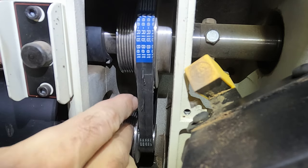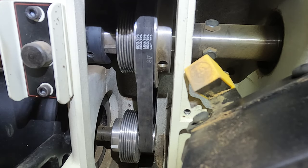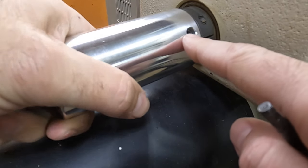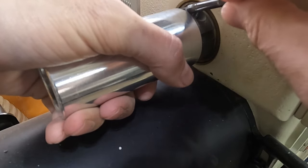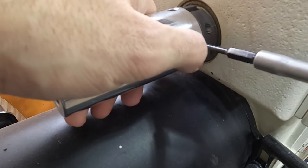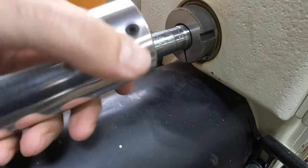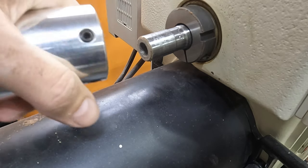As you can see, my belt is splitting — this is why we need to replace it. We've got some of the bands coming through it, but it's a solid piece that goes all the way through. What we're going to do is take off the hand wheel on the back so we'll be able to knock this forward and get the belt off. We have these two hex heads that hold the hand wheel onto the spindle. I'm going to back this hex head out until it's pretty much flush with the edge — do the same on this one — and that should allow the hand wheel to be removed. If it sticks a little bit, you can use the spindle lock to hold it in place and then twist it off, but it should come off relatively easily.